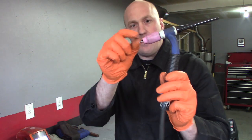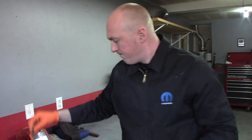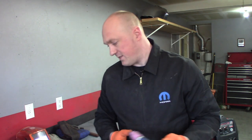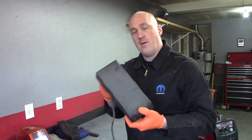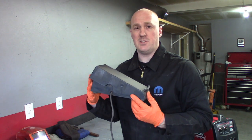There are different tungsten sizes: I have 1/8-inch, 1/16-inch, and the 3/32nds tungsten I'm currently using. I recommend 3/32nds because it's the most universal — you can do quite a variety of different metal thicknesses with it. The others have their uses in specific applications, but for all-around use, 3/32nds has been the best for me. Also, the TIG machine has a foot pedal, which is a big advantage: with the MIG, your amperage is fixed, but with the TIG's foot pedal you can really modulate the heat, slow down, or speed up as needed.